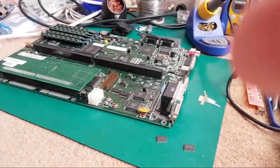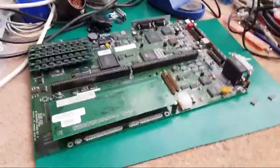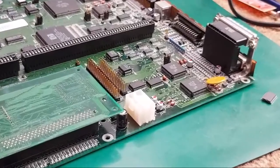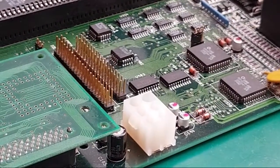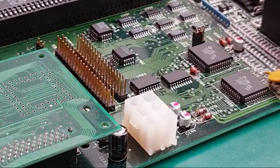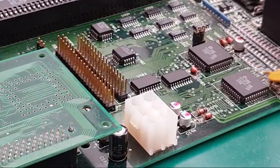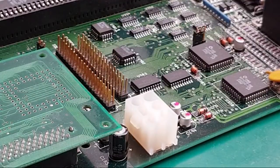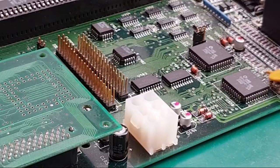Anyway, let's just connect the power to the camera here. Let's rotate this around. And I'll start by just removing those two chips. Hopefully won't damage, but they haven't been off before. So I'm a little bit apprehensive about this. So I'll get a little bit of Kapton tape around the things we want to protect here. It'll take a second.